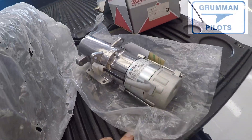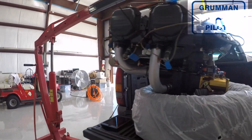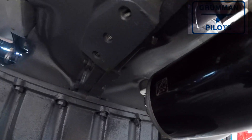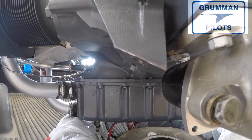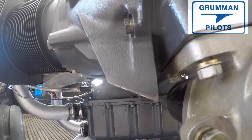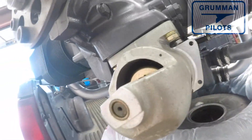It's a much better starter — this one at least has a core if you have to send it in for an overhaul. The Kelly Aerospace is pretty much just a good used, hardly-ever-used starter; it's had three or four starts on it in its entire life. It's coming off to go into the drawer with our parts, because the new engine is going with a new starter, new alternator, new voltage regulator — everything you've been seeing in the videos.